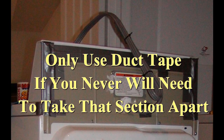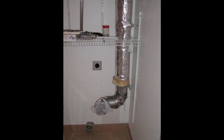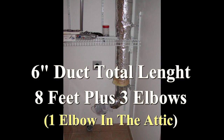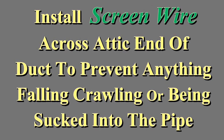If you miss a spot in wintertime, that cold attic air — which is heavier than warm air — will come down and leak out of any unsealed cracks or holes. You'll know this when you put your hand on the dryer and it's icy cold. The dryer might even be sweaty because the warm air moisture in your house will condense on it. If you have it sealed correctly, the dryer will be very close to room temperature.